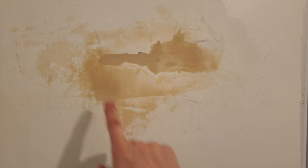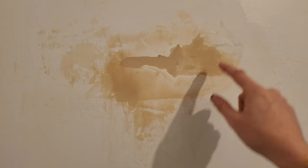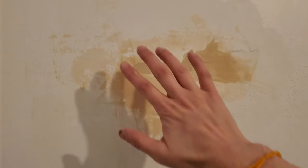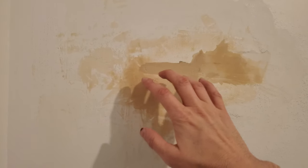The color difference here is caused by rust on the knives. I didn't clean the knives off before I did this because I wanted to see the area where the fresh mud got put. Most of the stuff out here will come off the first time I look at it with sandpaper. I'll prime it so the rust doesn't come through the paint, and I've put another coat on tonight so it's smooth.